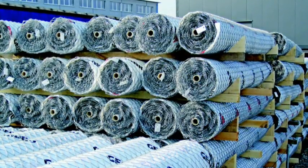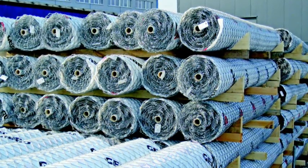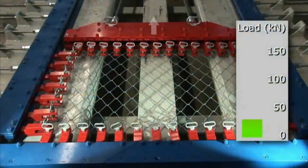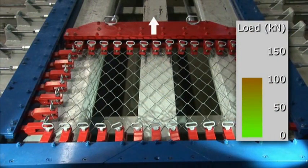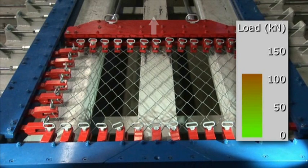DELTAX is a lightweight replacement of weld mesh sheets or heavy chain link mesh. For high-stressed, rock bursting or squeezing ground, the TECO G80 4mm chain link mesh is supplied. Both mesh types have a tensile strength of 1,770 N per square millimetre and can carry much higher static and dynamic loads than traditional reinforcement mesh. For optimal load transmission from the rock bolts to the mesh, a specially developed three-dimensionally shaped spike plate is available.